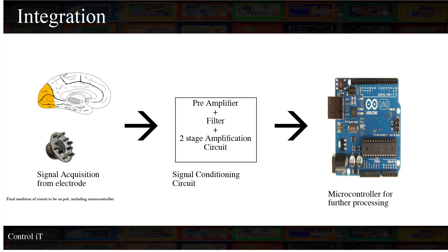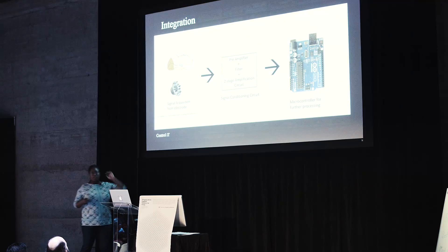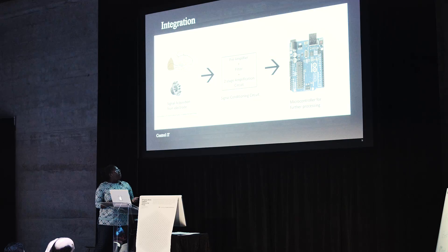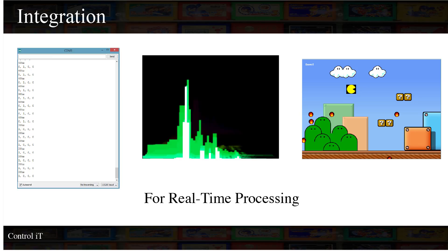For the integration, the electrode I used is pretty much just metal with little spider legs so it can penetrate through hair. You place it in the occipital lobe area, and this is just the signal conditioning circuit. You put your electrode, a wire runs down and attaches to the circuit, and then you put the output of the circuit into the Arduino — software does everything else. You can see here where I was testing it with different signals and observing the frequency output.